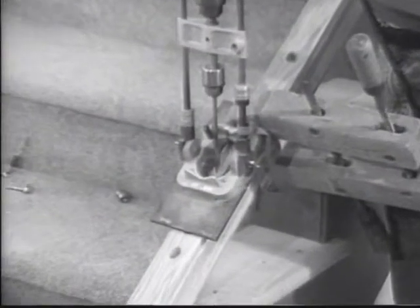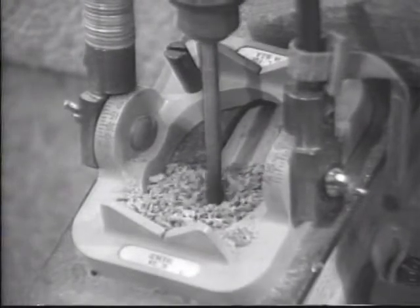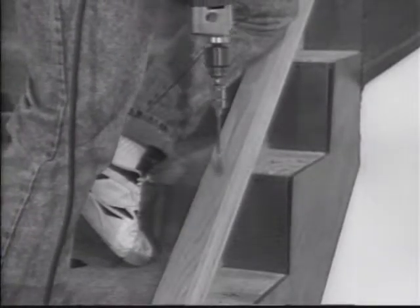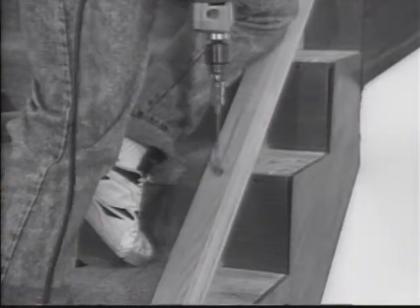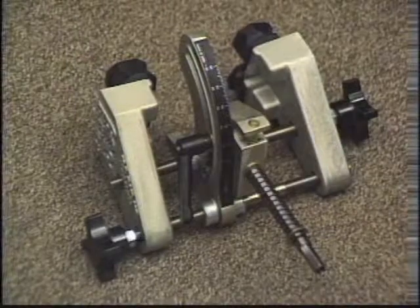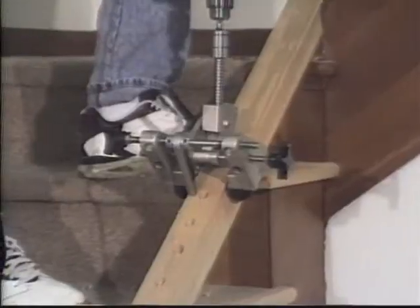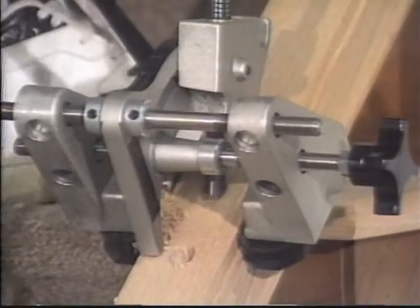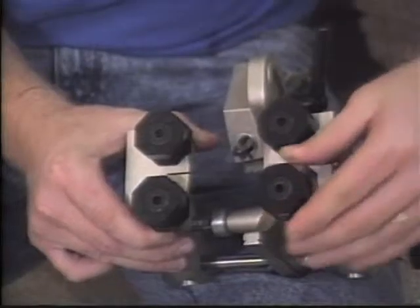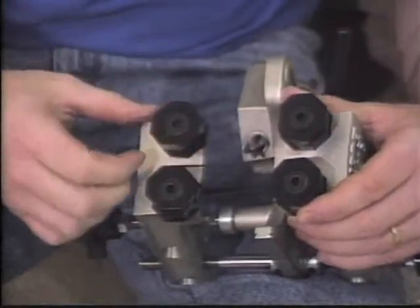When it comes time to drill holes in the rail for your balusters, it is recommended that an angle drill guide with a spade bit be used to ensure the proper angle when drilling. A second alternative, if a guide is not available, is to set the handrail upside down on the stair with the starting newel end of the handrail pointing up the stairs. However, this will often produce holes which are out of round and are not plumb. L.J. Smith is proud to introduce a third alternative: the L.J. Smith Bore Buster. The Bore Buster increases the quality and speed of handrail installation. This tool bores precision perpendicular or angled holes in straight or curved wooden handrails. It has precision pitch controls and fits the 6010, 6210, 6519, 6109, and 6400 profiles. It will permit fast and accurate rail bolt holes to be drilled.